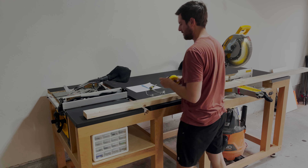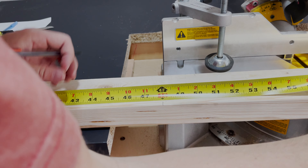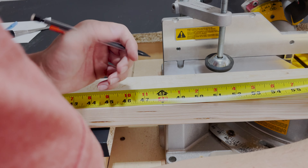To start out, we're going to be making three 48-inch long 2x4 boards. On this first one, you'll see me make a mark at 48 inches. I like to put an X on the side that I'm going to be cutting off — this helps with any confusion as you're going through a cutoff list to make sure you're putting the saw on the correct side, so you're not cutting the board too short or too long.